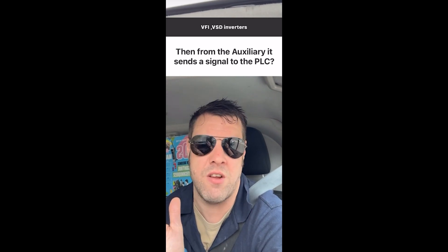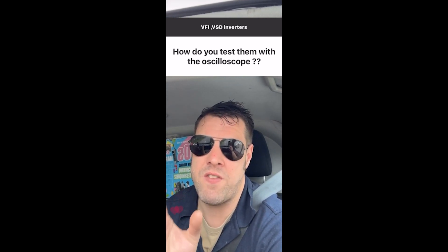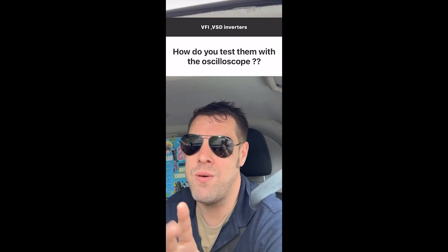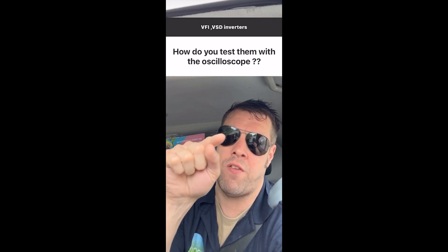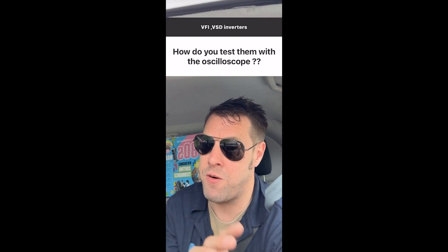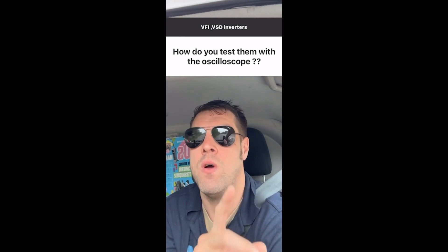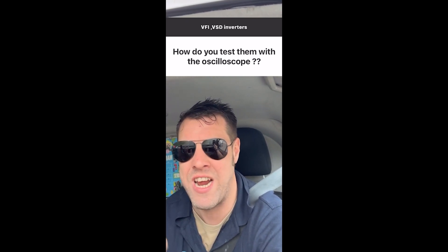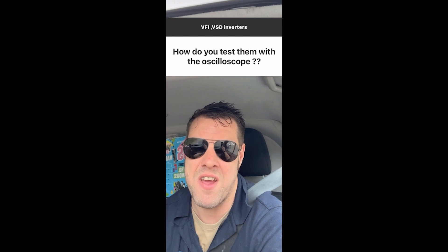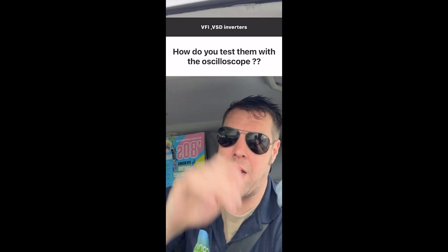How do you test anything with an oscilloscope? As I showed in those videos on the drives, you measure the speed of the drive against time — an oscilloscope measures voltage against time and does a bit of frequency as well. On the oscilloscope you'll see the waveform of each phase. Stick it on the output and you see a waveform — good. Stick it on the next output — waveform, good. Stick it on the third output and there's a waveform all jiggery and all over the place — you know one of your phases has gone. Remember, you've taken the phases from the national grid, chopped them up, and produced a mini-grid on the other side. What often happens is one of those rectifier bridge circuits goes wrong — you'll have a nice harmonic phase, a nice harmonic phase, and one that is completely off.